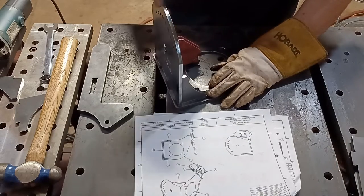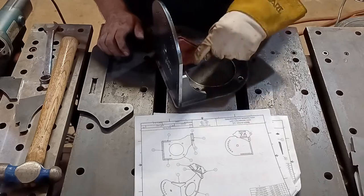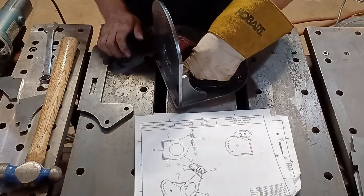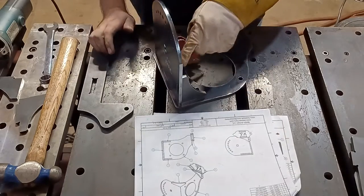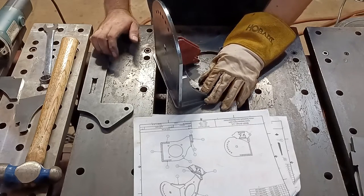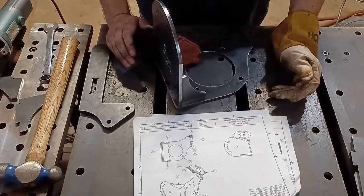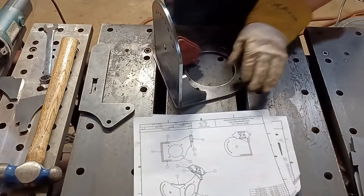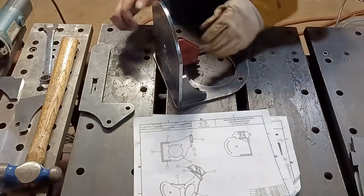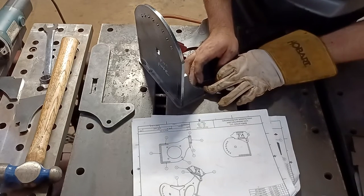Never weld the inside 90-degree joint first because that creates the most leverage. If I weld a gusset and it moves a little, does it matter? Absolutely not — cosmetically it doesn't look great, but it won't change the function. If I tack the inside joint and it moves the main piece, now it's going to cause problems. So always tack your gussets first. These gussets exist to help you have a much better result and are really what made this build idiot-proof.